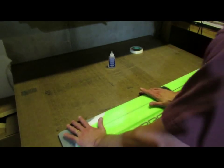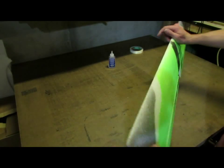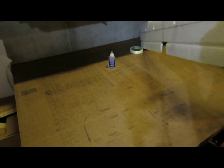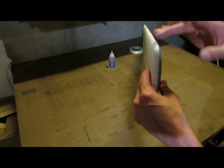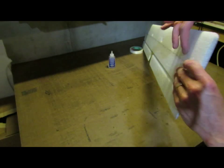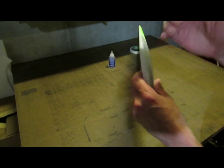And then I also want to press down on the wing, make sure it's nice and flat. And then I also will sight down that leading edge like that, and just make sure that there's no bend. Right now there's a little bit of a curve down right here in the wing. And so all I did was flex that just a little bit. The spar on bottom will stay still, but the spar on top will let that foam compress, and that's how I straighten that wing out.